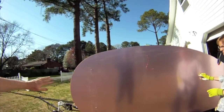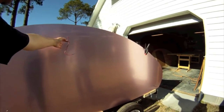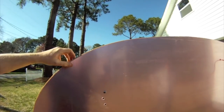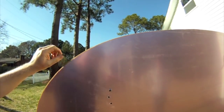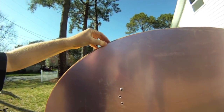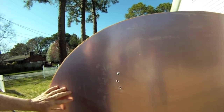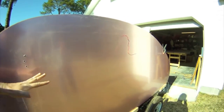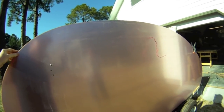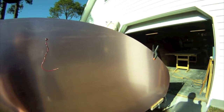Here's the aluminum just temporarily fastened onto the side. You can see the penetrations for all the wires and whatnot. I've got a little gap or a little bit of space right here. Ideally, when I put the trim on, this space will allow the aluminum to expand into it when it gets hot, so I don't get oil canning of the metal. I'm just leaving a little extra slop there and we'll see how it works in practice.